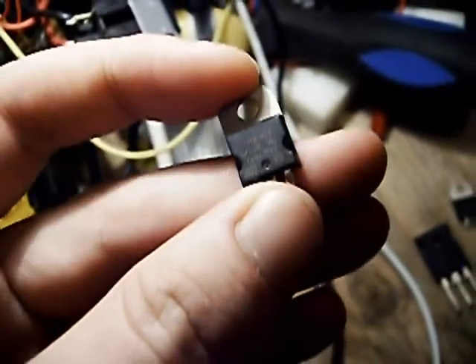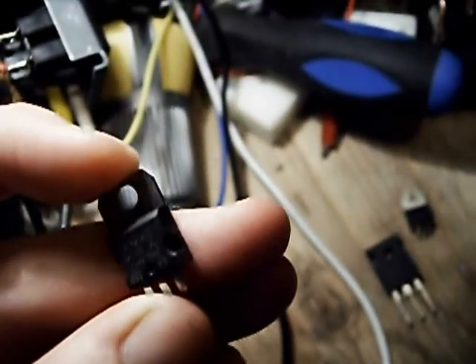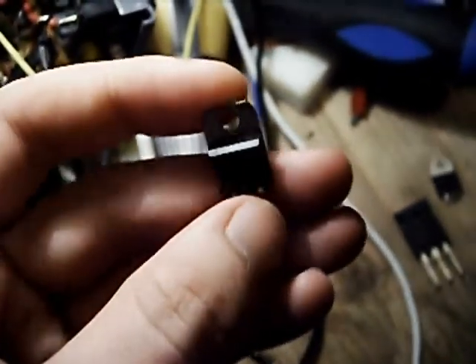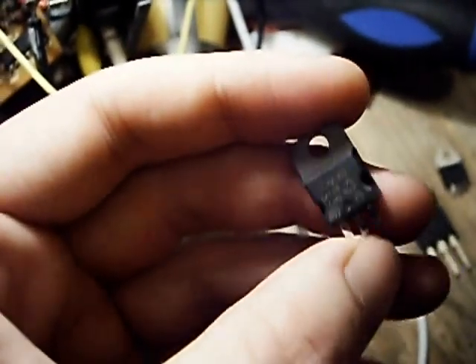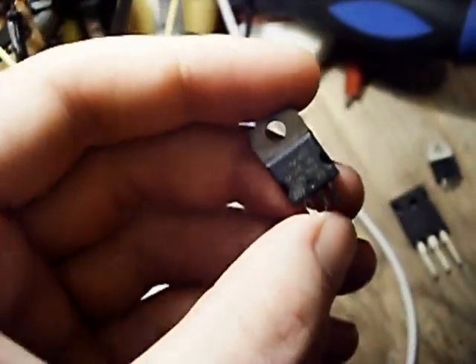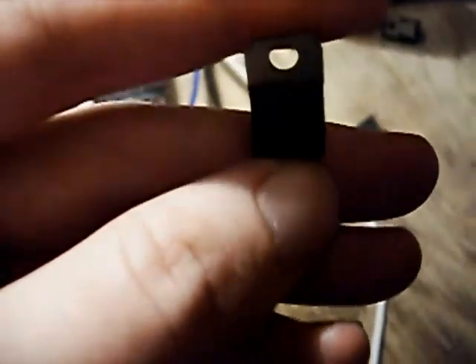The top of the logo on the suspect MOSFET isn't very even, and there are voids where the ink or paint was never properly applied. It's a Chinese piece of crap. The other MOSFET might also be fake — although given how poorly made this whole board is, these might be quote-unquote genuine STMicroelectronics devices that are just hideously made.